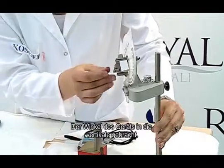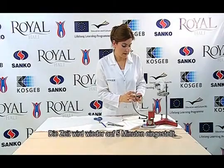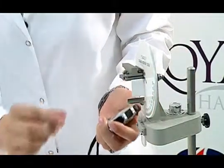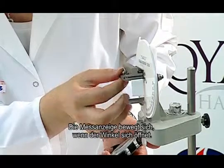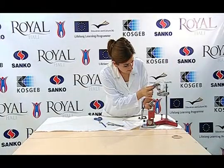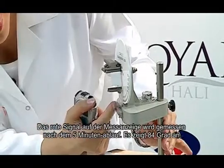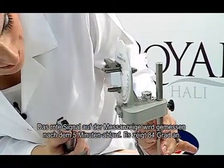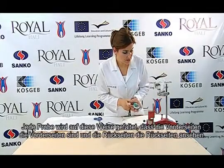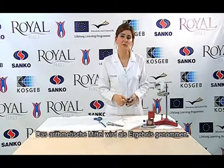The angle of the device is put at a vertical position. The time is set to 5 minutes once again. The gauge moves as the angle opens up. The red sign on the gauge is measured at the end of the 5-minute duration — it is 84 degrees. Each sample is folded in a way that the front side faces the front side and the reverse side faces the reverse side. The arithmetic mean is given as the result.